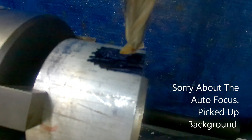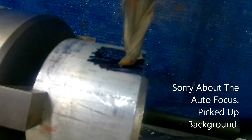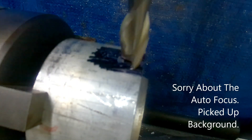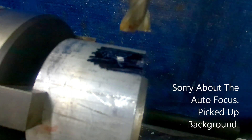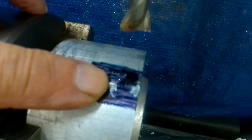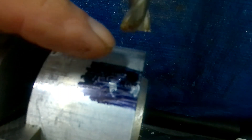What you're seeing here now is a piece of aluminium — or aluminum as you Americans call it — set up in a dividing head. This is a standard two-flute slot drill. I'm going to carefully just touch on there, and by spinning this round, yes — you can actually see that it's only touched on the outside edges. So imagine you were milling that all around — that is why you tend to get a bump.